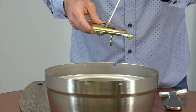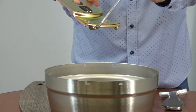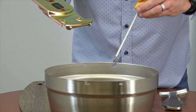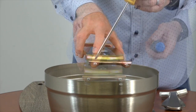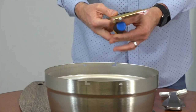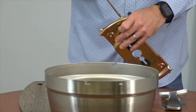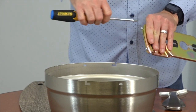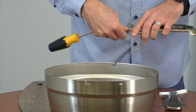There are two screws on either side of the mounting bracket that will align with the L-slot and the standard screw hole of the motor housing. These screws hold the motor housing in place when installed. The screw on the left will align with the L-slot and the screw on the right will align with the standard screw hole. Begin by first loosening but not removing the screw on the left side, then loosen, remove, and save the screw on the right side. Repeat this for the other side of the mounting bracket.